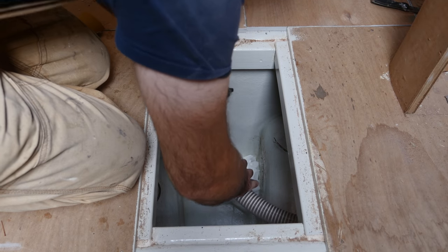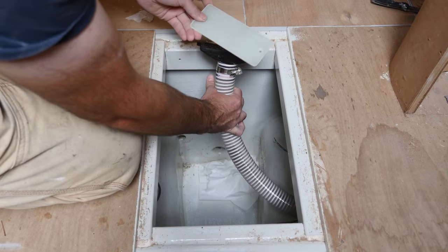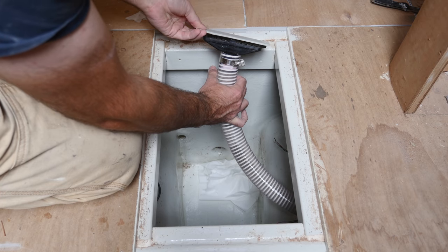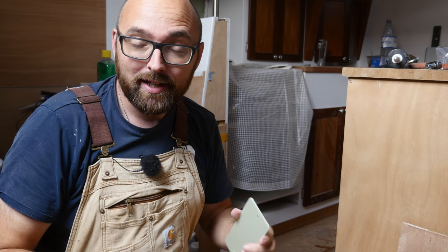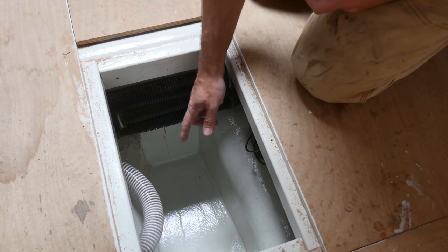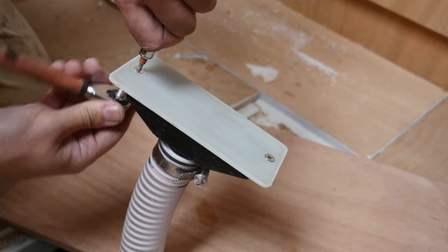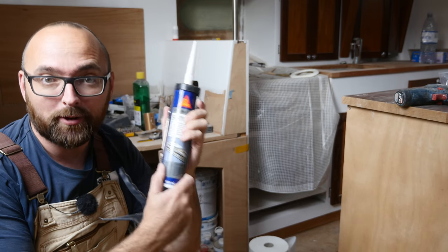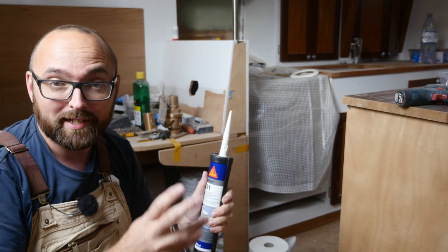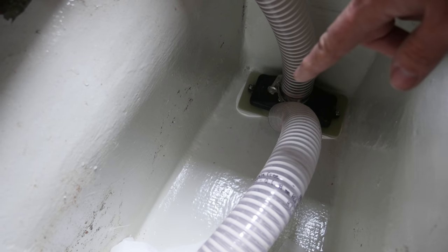The strainer attached to the end of the hose has two little holes in it. I've made myself a little piece of fiberglass that matches up with those two holes — the plan is to glue this to the bottom of the bilge after it's been bolted onto the strainer. Putting this little thing in between the strainer and the bilge might seem like extra work but it prevents me from drilling holes into the bottom of the bilge, and even though I do have a false bottom in my bilge I don't want to drill into that and risk water getting into the sandwich construction. I've already cleaned the surface down there so now I'm just going to very lightly abrade it. I don't need a super strong adhesive bond for this so I'm just going to use a little bit of Sikaflex 591 — it's plenty strong to secure the hose yet I should easily be able to remove it again if I ever need to. That looks good to me — I've used another piece of hose just to wedge the strainer in place until the Sikaflex cures.